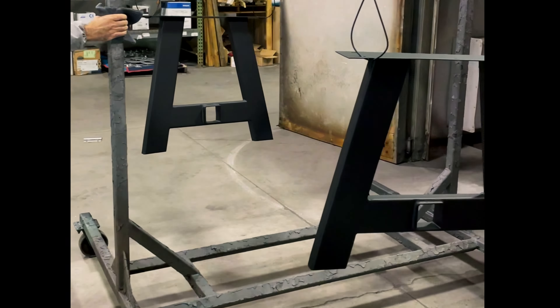The two things that gave me the most anxiety about this build were the flattening process and insetting the legs and support channels in the bottom — that and dropping it on myself or someone else causing grievous bodily harm. After a light sanding, I decided not to flatten the bottom, because the curve was unnoticeable now that the top was flat, and I was afraid it would look unnatural at the edges and ruin the live edge look. This C-channel needs to be placed inside a slab table of this size to prevent the wood from breaking or cupping with temperature and humidity changes. Along with the legs, they have a round hole in the center but elongated holes on the outside edges to allow for expansion and contraction, while the C-shape of the channel will keep everything nice and straight over the years.